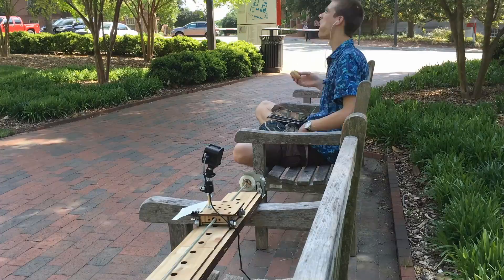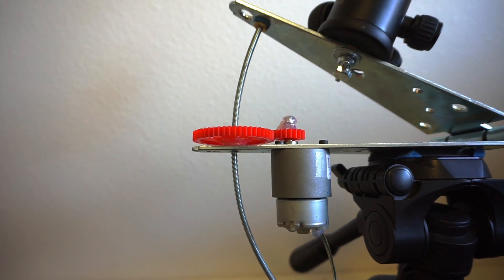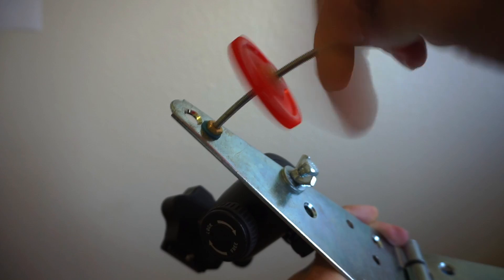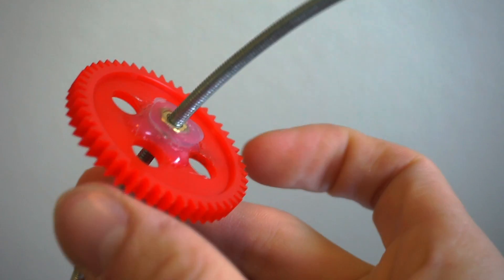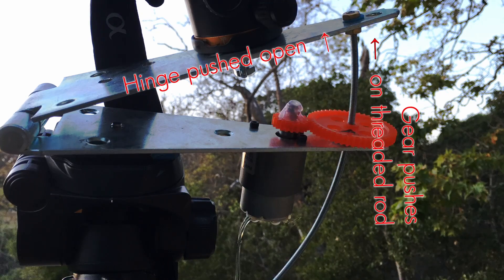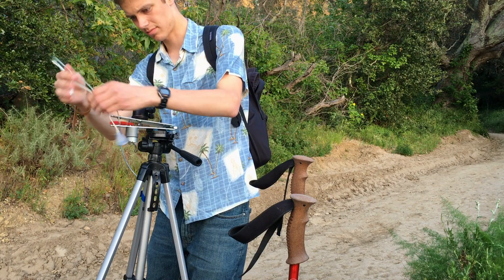The mechanism is actually very simple, and quite similar to the time-lapse slide that I built last spring. This curved section is a length of 8-32 threaded rod that I bent by hand into a semi-circle — it doesn't need to be super precise. It's anchored loosely at the top with some dampeners from my box of quadcopter parts to give it a little play. The threaded rod goes through a hole on the bottom half of the hinge, but in between there's a plastic gear with an 8-32 nut hot glued in the middle. As this gear spins, it meshes with the arc of threaded rod and pushes off of the bottom of the hinge, so the top of the hinge is forced upwards.